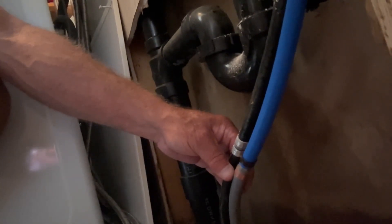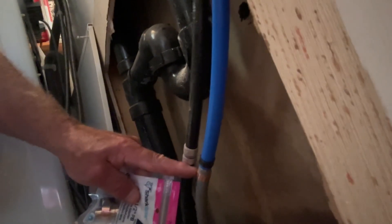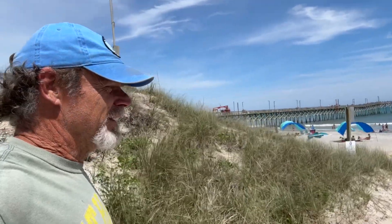It is now holding water — we have the water turned back on. I want to replumb all of this properly, but for now we're back in business. And that's what you can do with your adapter if you don't happen to have a crimp tool specifically for the polybutylene crimp ring. Now I get to go to the beach.